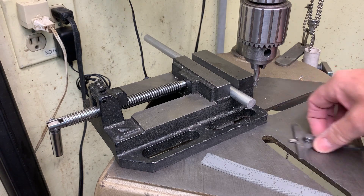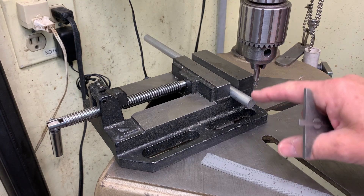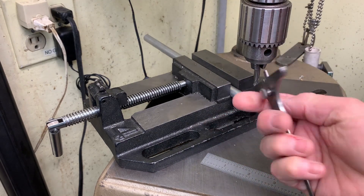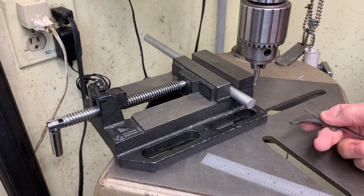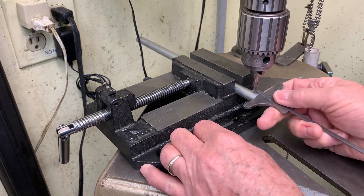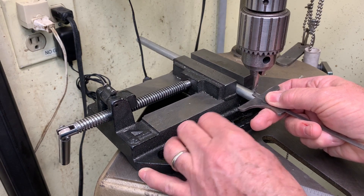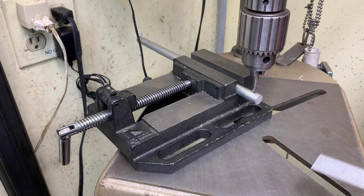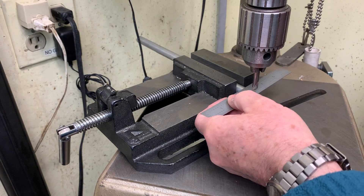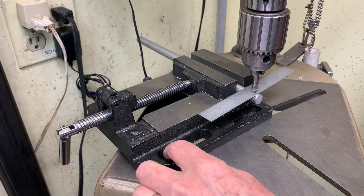The old way, which is arguably the best that I have found: if I want to cross-drill through this rod at a given distance from the end, I'm lucky enough to have a depth gauge. So what I would do is, with the drill press having some friction on it, I would set the depth first, and then I'd use this very old but amazingly accurate technique of putting a steel rule down and pinching it with the point.